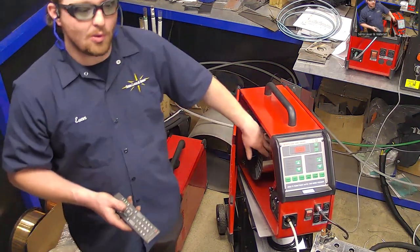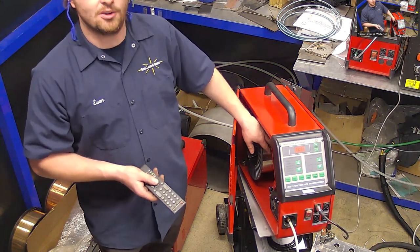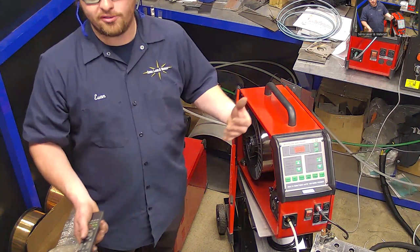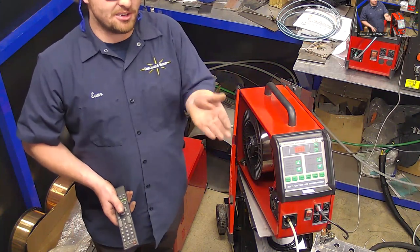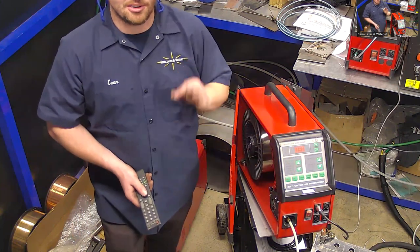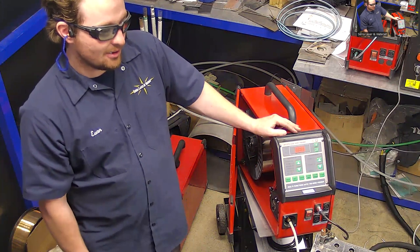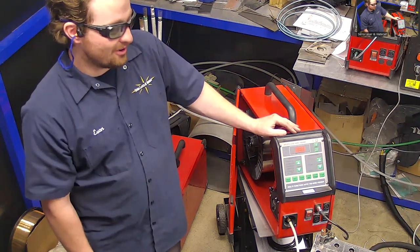And you just use normal wire. I didn't mention that. This is just standard solid core MIG welding wire. And I use 0.045 diameter unless my material is thinner than the wire. But for this piece, 0.045 diameter is perfect. You can use 0.030, 0.035, 1/16. I like 0.045. Just what I found works good with this.